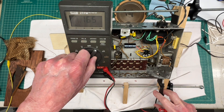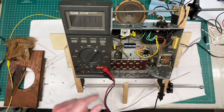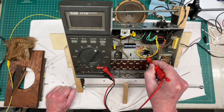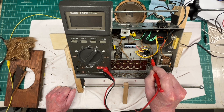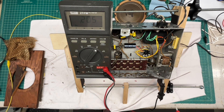Let's look at the DC voltage. Let's look at the center tap, which goes to chassis ground, back over to each side of the transformer on the AC side. If you guys followed along, I tagged one of the leads red and one blue. And 255.9, almost 256, and 256.7. So pretty well balanced there. My line input voltage continues to fluctuate about a half a volt as well.